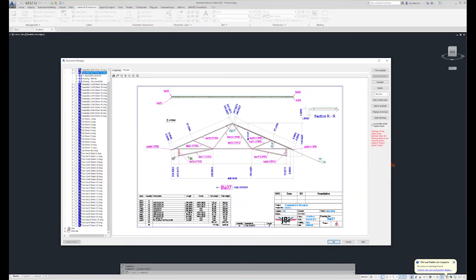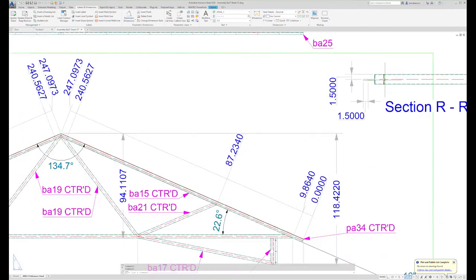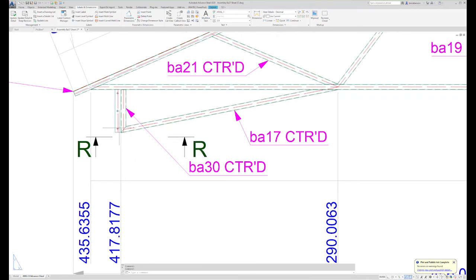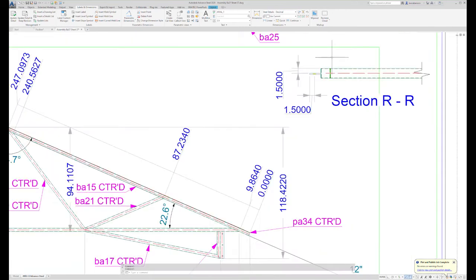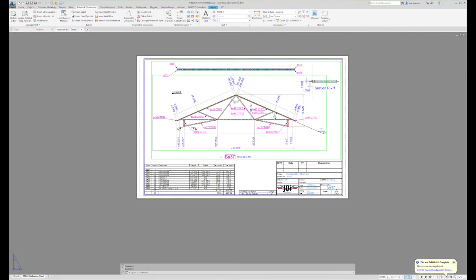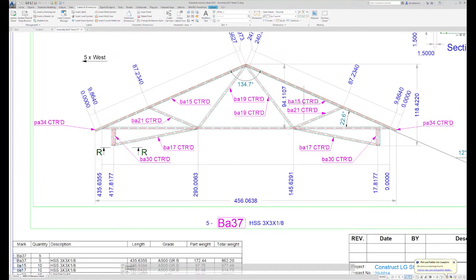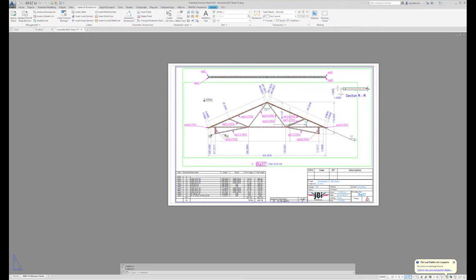Okay, last look at our assembly drawing for the truss. Like I said again, I think I have all the dimensions on the truss to lay out all the single parts. We also have an additional view at the lower corner of the truss, so we know again that we have to put this shear tab on one side, center our tube 1.5 inches in, so that it will fit correctly in the field. We also have our compass showing which way they are going to be installed in the field based on this tab location. We also have all of our part IDs or labels. Again, I think we're at a point where a skilled fabricator with experience would be able to lay this out.